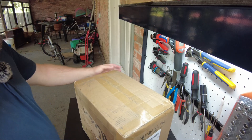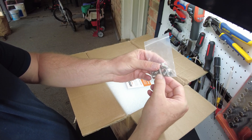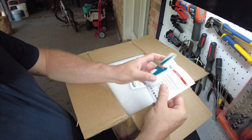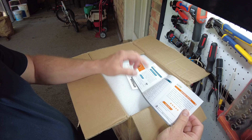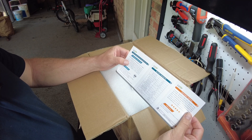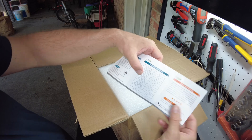Let's open it up. So we got terminal bolts — looks like M8s. We got some short ones and long ones. The user's manual says rated capacity of 200 amp hours, but I think that's wrong. You can connect two in series and four in parallel. You can continuously charge at 120 amps and max continuous discharge at 120 amps.